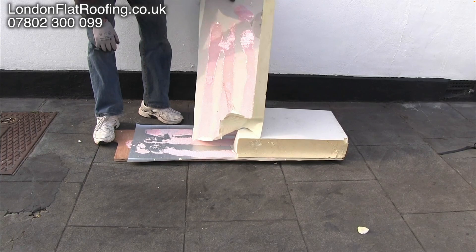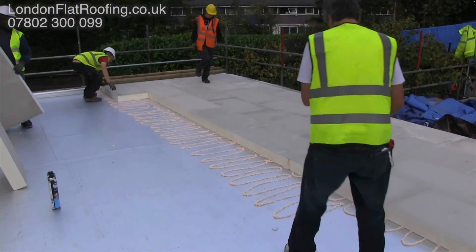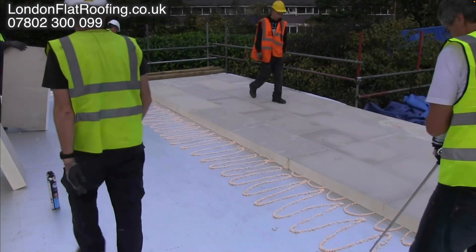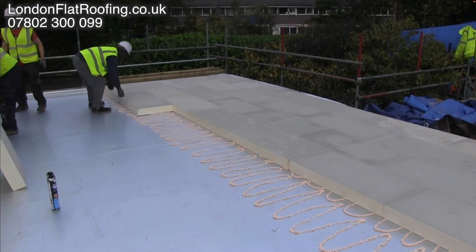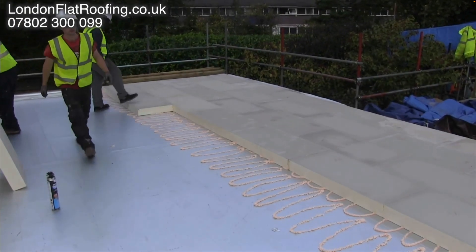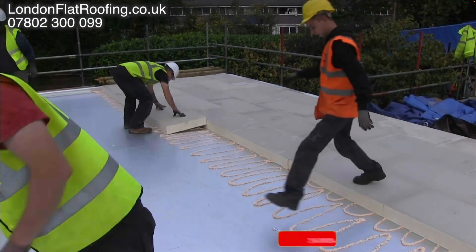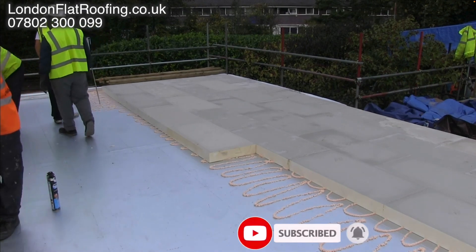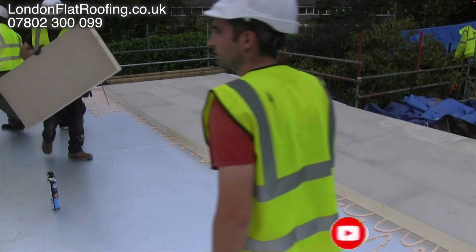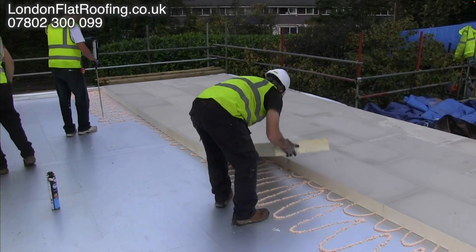So where did it all go wrong? This is the problem that we had - gluing this down failed. I talked to all the suppliers and at the end of the day, it was decided that the reason it failed is because there was too much moisture in the insulation. Therefore, nobody took responsibility. The people supplying the insulation said it was awful, and the people supplying the glue said there was too much moisture in the insulation. That's why I like to now only use thermally broken fixings.